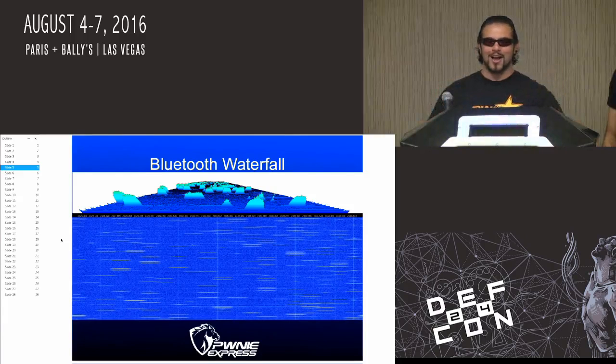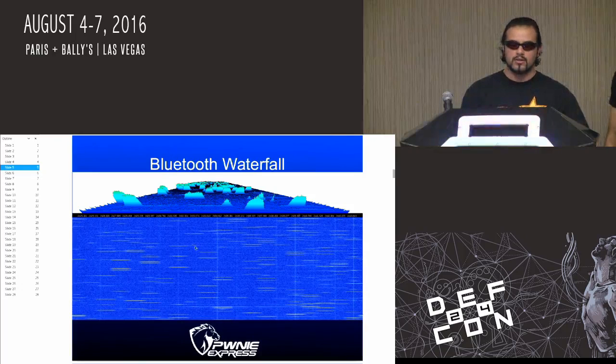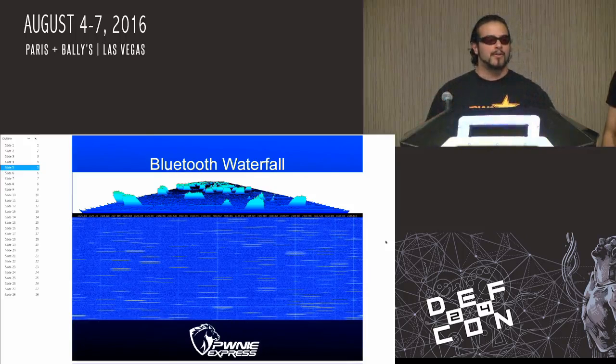This is very high quality. As you can see, very, very little actual data is being sent. On a network where you would have a large Wi-Fi network possibly right in the middle of this, you'd actually see all the Bluetooth go below and above using what's called adaptive frequency hopping. It's basically just going to avoid interfering with the Wi-Fi and avoid being interfered with by the Wi-Fi.